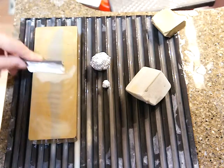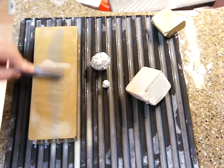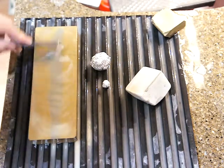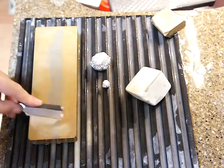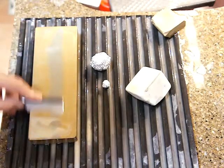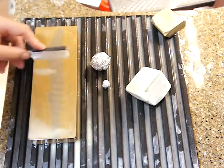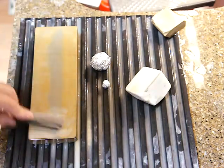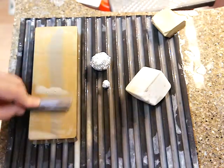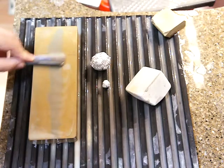Usually, if I start sharpening from a medium grit, medium-high grit like botan, then after that koma or tenjo or mejiro, and then start doing the finishing stone itself, or with Nakayama Tomo Nagura. On the final sharpening like this, I usually take 30 minutes to 1 hour to remove, little by little, the scratches from the lower grit. It takes a long time.